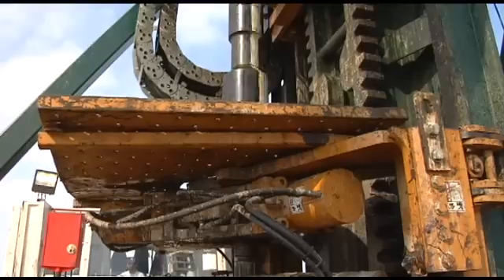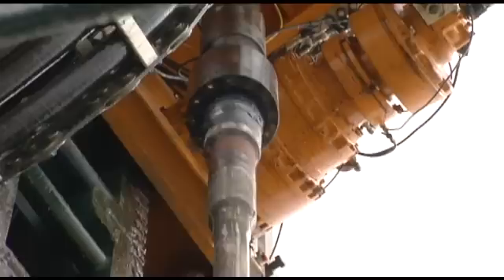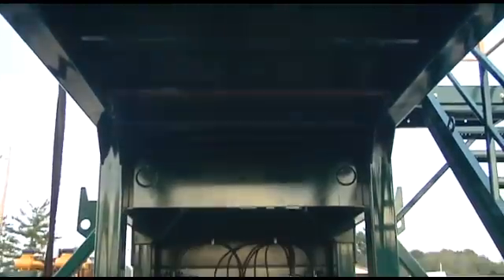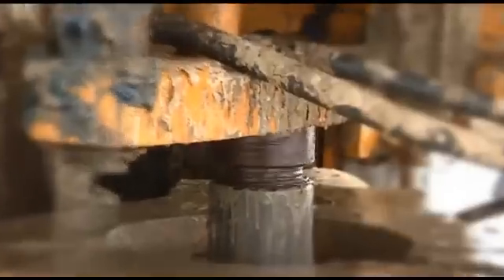The VR500 pipe wrench utilizes an open-side style with an 8-inch clamp cylinder and accommodates range 3 drill pipe. With 100,000 foot-pounds maximum breakout and make-up torque, it's powerful enough to get the job done right. The drilling floor features a removable 4x8 section, providing easy access to the wellhead and BOP.